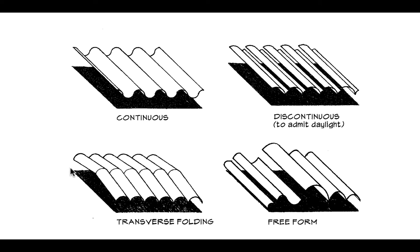This is a very simple arch — basically a triangular arch where we've just given a little elevation to the center, hacking it a bit to get some of the tension out of the system. In the short direction, these curved shapes are not functioning as arches but as long vaults, functioning as beams from one set of points to another.